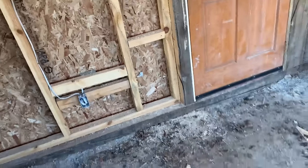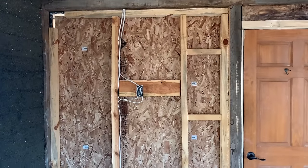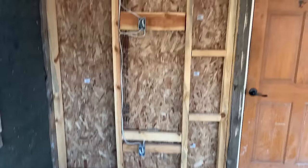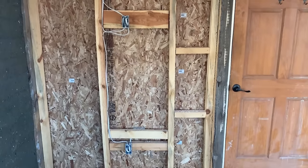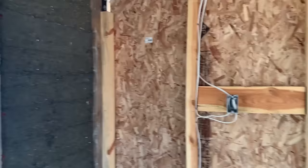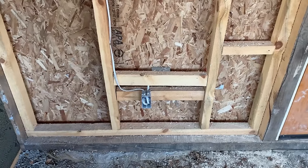But I like to stay reasonably close, and particularly doing this in the cold weather season, it pays to do a solid form on the outside of the wall, and then I'll just use planks and work them up as I fill this. That way I can heat the building on the inside and it will keep all this Dustcrete warm enough to cure in a good way. And we'll get some forms on, mix a batch, and press on.